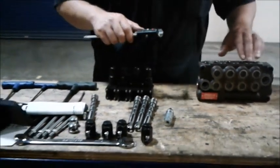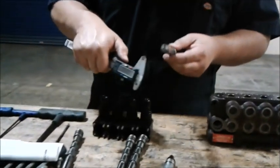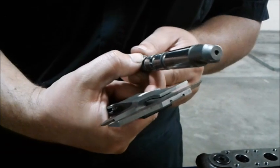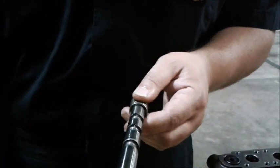Measuring this, you would do the same thing on the opposite side, once again recording your findings. I'm just going to demonstrate on one — it's the same principle. You measure one way and take a cross measurement, but you only really need to measure these two portions because those are the ones that help keep the hydraulic fluid contained inside the system.